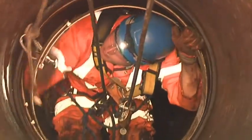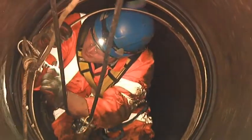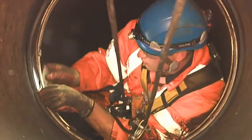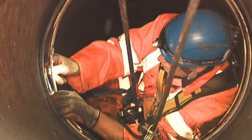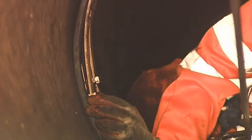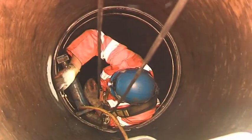The second stainless steel ring is then positioned onto the rubber seal and fitted into place. Both stainless steel rings are then expanded using the hydraulic ram, and stainless steel wedges are driven in to maintain compression against the seal.